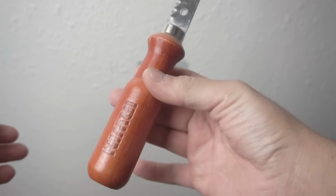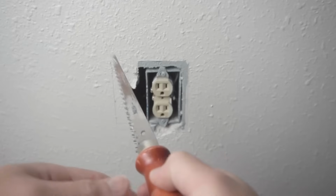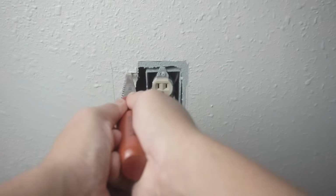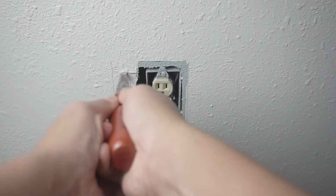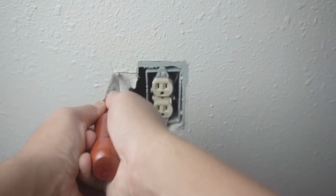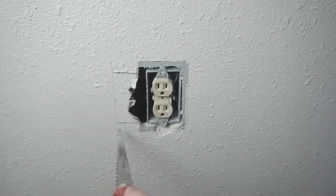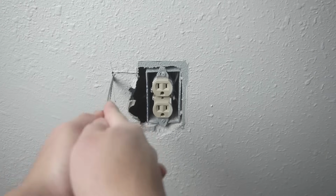And again, be very careful when you're working around this because this is live wiring. Make sure you turn off the power from your circuit breaker. What I'm using here is the drywall saw. Again, all the tools I use in this video, I'll leave in the description down below. We're just relieving off around 2 inches around this damaged area.